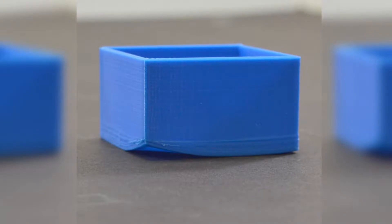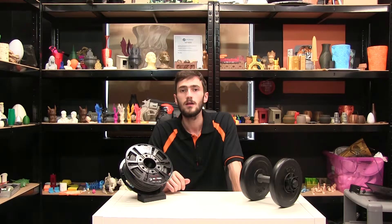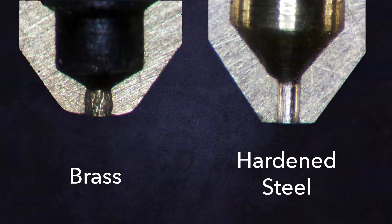Compared to using only PA6 Nylon alone, Carbon Fibre means you get improved chemical resistance, less moisture uptake, and low shrinkage and warp. It also has excellent stiffness and printability, as you can see from the detail on our handlebar and its low gloss surface. Please keep in mind that carbon fibre reinforced filaments are abrasive and can easily wear down a brass or aluminium nozzle. That's why it's recommended to use a hardened steel nozzle when printing.